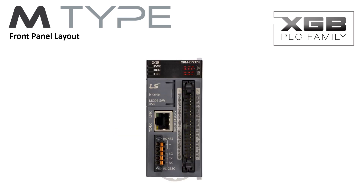The M-Type PLC's visual indication includes power and CPU LEDs, allowing the user to see the power condition, operating mode, and status of the PLC. The I/O status indicators make for easy startup and maintenance of the control system. The I/O indicators illuminate with the I/O address when active for positive identification.